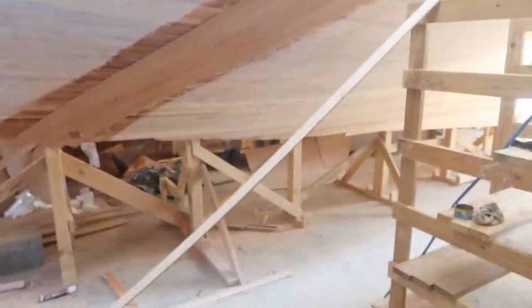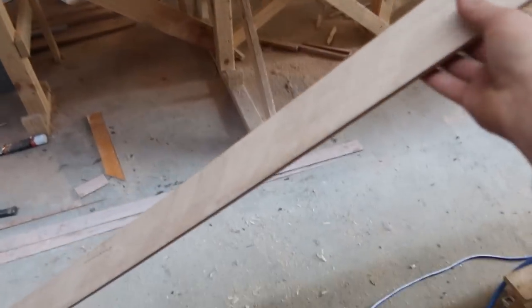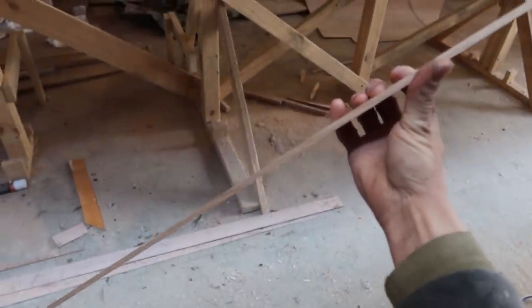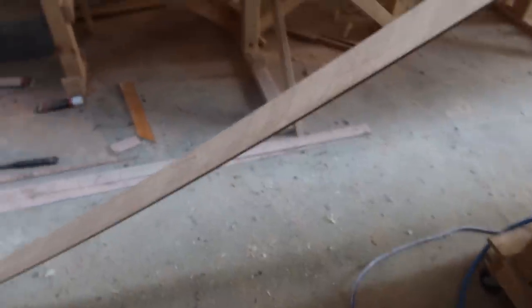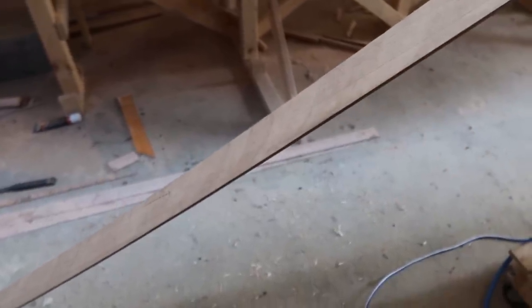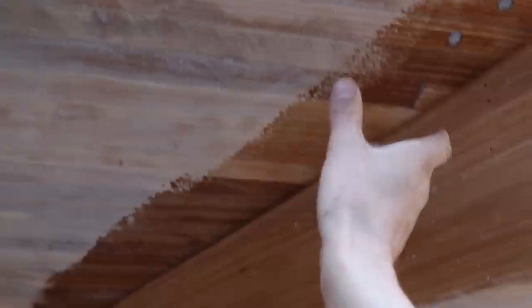what's happened here. So the wood we are using is about 70 wide and, well, actually 1/4 inch thick, so 6.35, I think, mil thick. We're buying 90 by 35s. We can get 4 pieces of this, ripping it up with the saw. If we went any wider, I think we'd have sort of a bulge. I think with the 70, it's quite good.